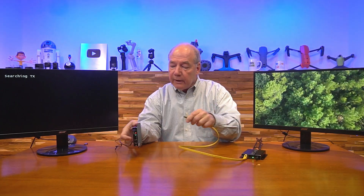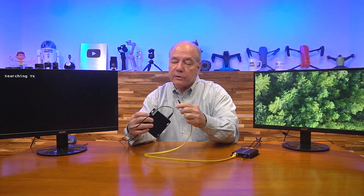The only connection missing is the LAN cable between the two modules — it should be Cat 5e or Cat 6. I have a short Cat 6 cable here. I'll plug one end into the LAN port on the transmitter and the other into the LAN port on the receiver. The minute I make that connection, the two modules negotiate the best possible picture quality for the remote location — and there you go! The same exact media content appears on both monitors. Remember, this can be up to 250 meters apart.